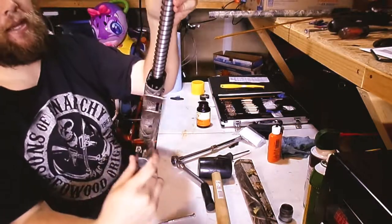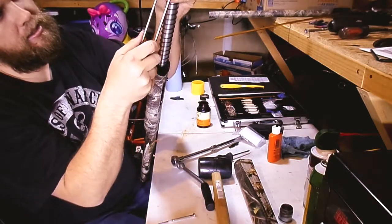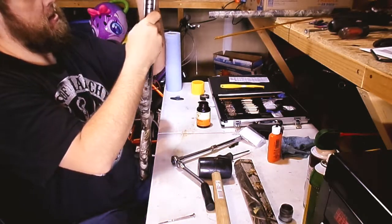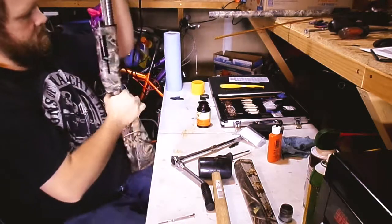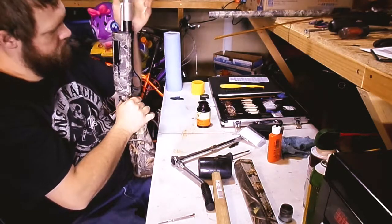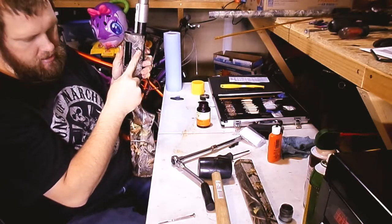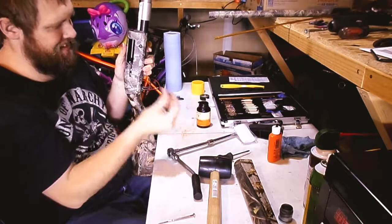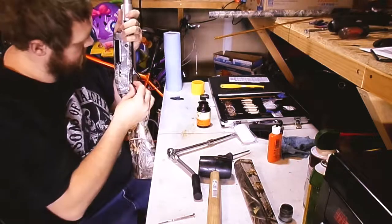So on how you put this on, it's got these two little pins right here. You'll put it on like this, and then you'll slide it forward and down at the same time. Then with your bolt on, you'll just take it all the way back. What's neat about this is you don't have to hold it. What I like to do is just pump it all the way down. Then it's held in. Now if you push the bolt release button right here without your charging handle in the gun, everything will fly off. Everything will literally fly out of this.